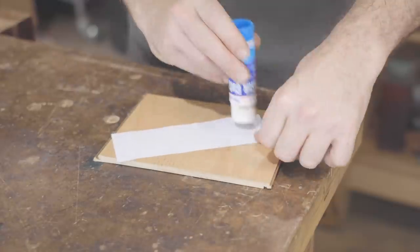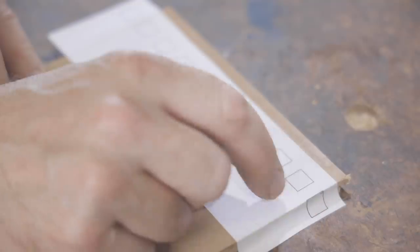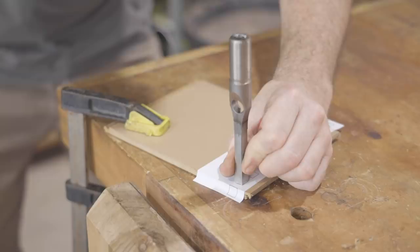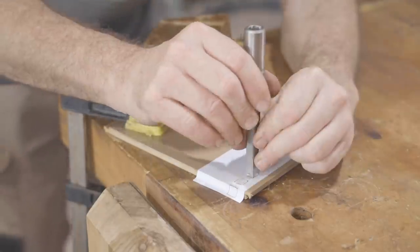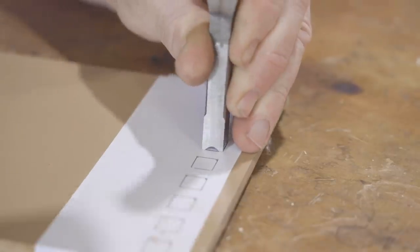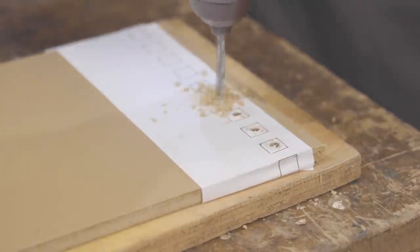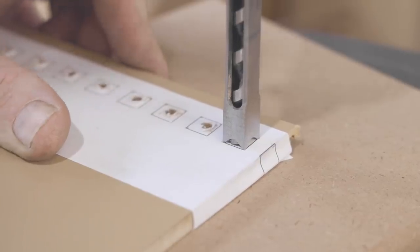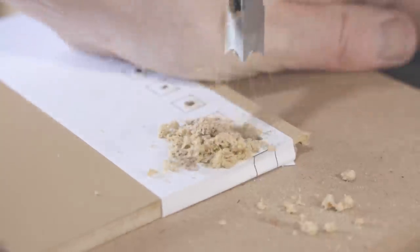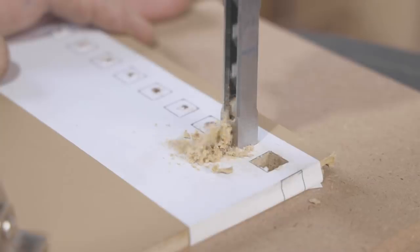I'm using a template that I printed and made in Illustrator. The squares are 3/8 of an inch and the gap is a quarter of an inch, so I put a gap at the end and that's why I folded it and started the template there. I've taken the drilling chisel apart and using the chisel I'm marking where the holes need to be, paying close attention and being as precise as I can. When I come to cut these out, the point of the drill will interfere with locating the chisel back into those marks, but it only takes a minute to drill those centers out and that will solve it. I'm being extra careful to set the chisel back into those marks — this may not be 100% accurate but it will be close enough. When the setup's complete, the joints will take no time at all to make. They're a very strong joint and quite unique, so it's worth a little effort now and the setup's really not difficult.